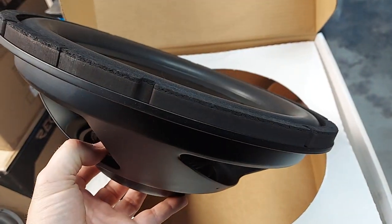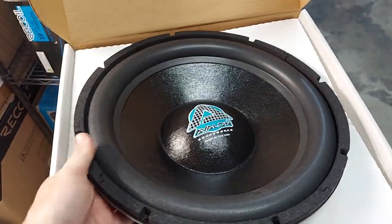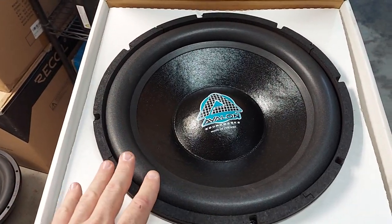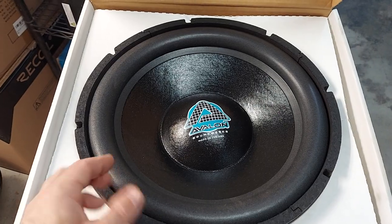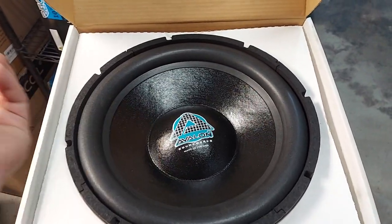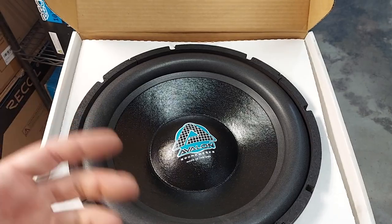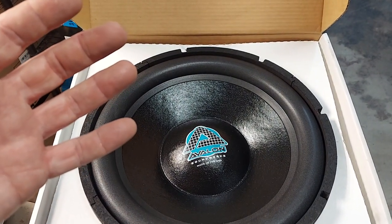These are really affordable. The 12-inch is $40 shipped and the 15-inch is $45 shipped. Then you figure out how to add your mass — there are several ways. You can use epoxy, or front-load by cutting off the cap and adding mass underneath then adding a bigger cap. For tuning, what I'd do is mount it normally and start adding Silly Putty or clay to the cone area to figure out how much mass is needed to tune your enclosure.